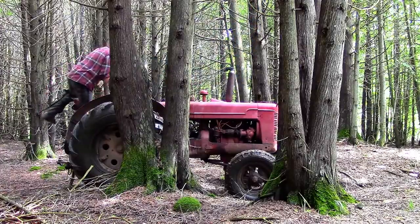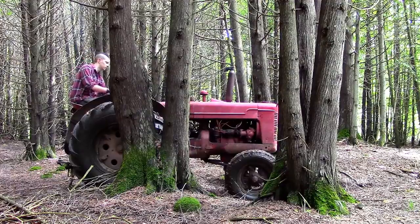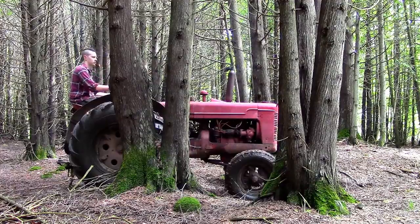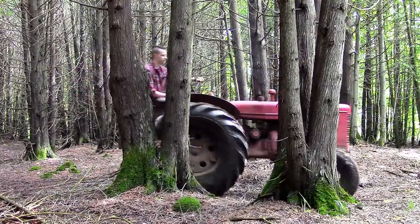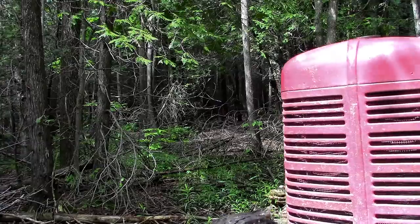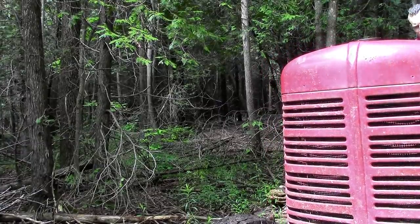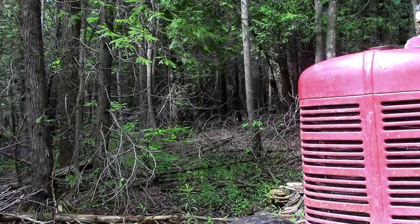The tractor always had some trouble starting for me, but it was getting worse. The problem was that the ring gear was damaged, which made it difficult for the starter gear to engage it. As well, the electrical system was beginning to fail and needed a thorough going over. I knew the problem needed to be fixed, but I hoped the tractor would hold on until the end of the summer.